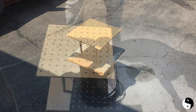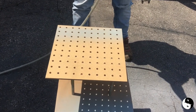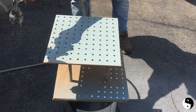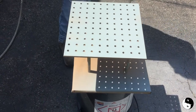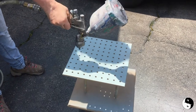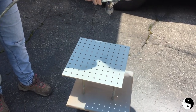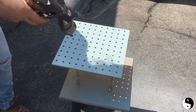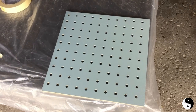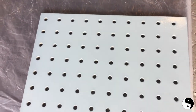Now we're actually going to spray this piece of pegboard. Make sure to stop it off the edge each pass. One more pass. I actually did better on the practice board than on this one — I was too low to the board and got too much flow, so it's a little bit thick. I didn't get drips though, so it will probably level out.